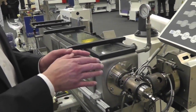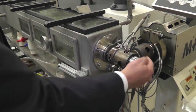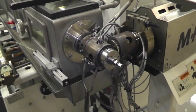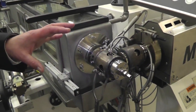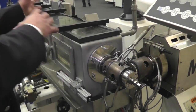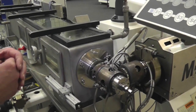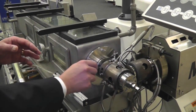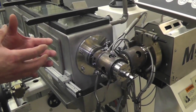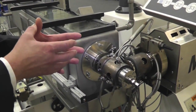This is a cross head die — you could also have inline dies. This cross head has the ability to blow air into it. For very small tubes, we can use micro air control for the ID and blow the tube up. Here we're sizing it, but you can blow air in the back to give size control. It's a very low volume head so we don't want a lot of volume in the tool that could degrade the material — it's very well matched that way.